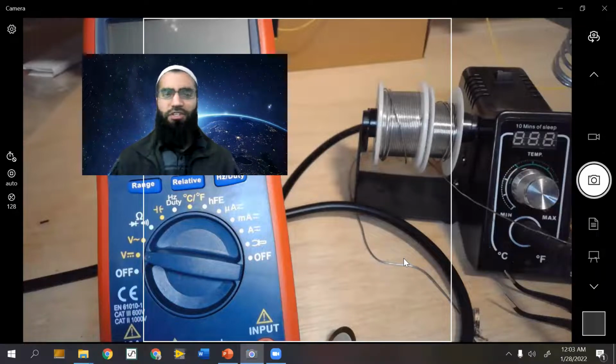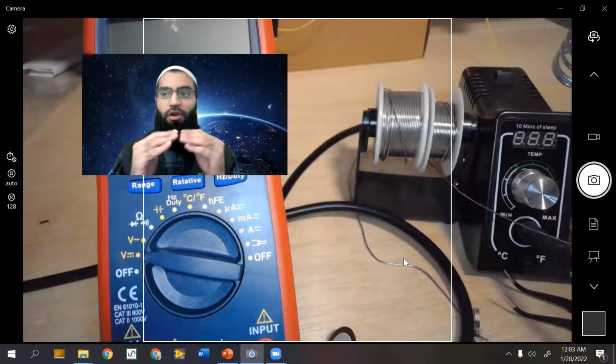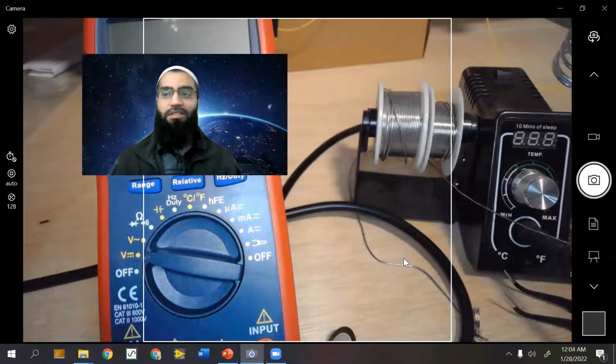In the case of the buzzer, it's not the ideal device to be demonstrating this. The reason is because it's a unimorph, so there's a brass and there's a ceramic there. So basically, when you heat it, the ceramic's not going to expand, the brass is, so it's going to get some curvature in there, which actually creates the opposite effect. In the case of the buzzer, the structure of the device is going to dominate that charge generation, or the temperature coefficients rather than only the pyroelectric effect. But it was just something for demonstrating here.